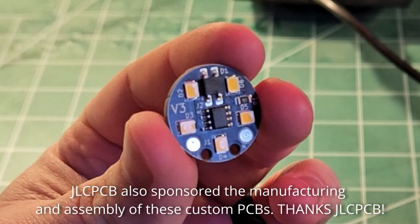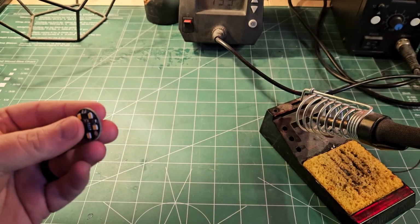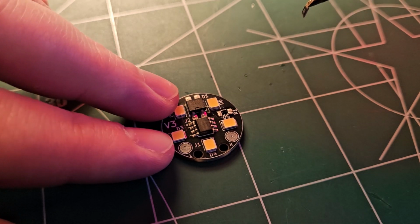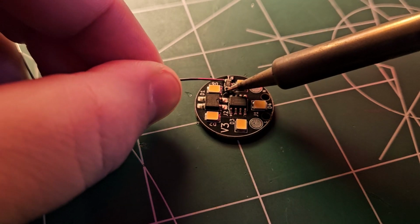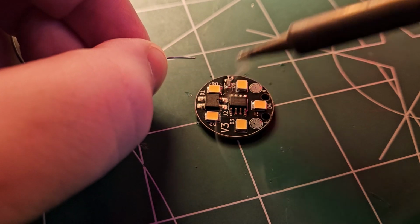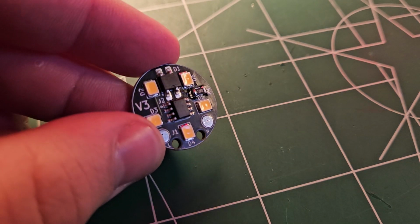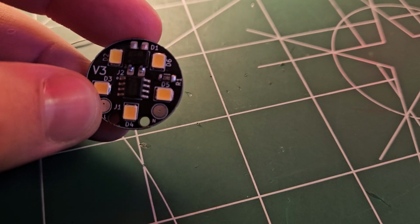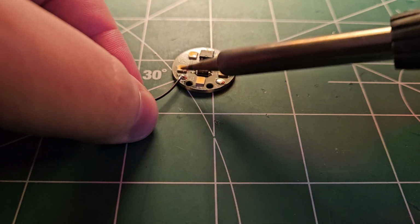If you've been subscribed to my channel for a while, you've probably seen these little custom PCBs that I've made in other projects. I decided to use them again here, and all I had to do was replace one resistor value so that they shine just a little bit brighter. With the correct resistor installed, it was time to attach the power leads.